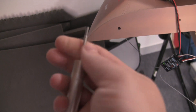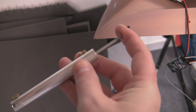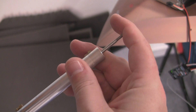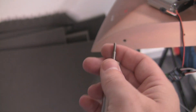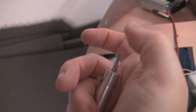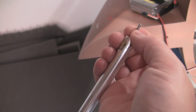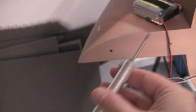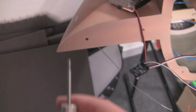This is the actual air cylinder that opens and closes the canopy. With full closed, it would only go that far and you'd still have that much travel left. Because the canopy is fully closed, it just sits there and the pressure holds it closed. You'd like your air cylinders to go their full travel to the mechanical stop at each end. But SkyMaster often has things set up where they're stopped by the door or canopy being fully closed rather than hitting a mechanical stop.